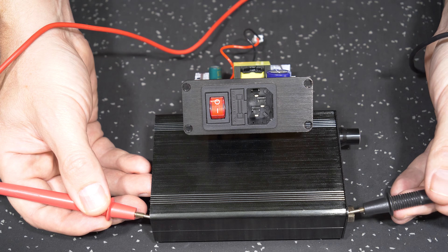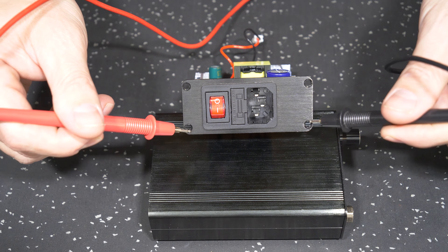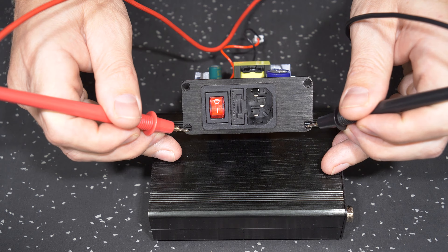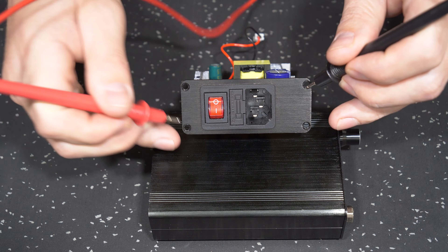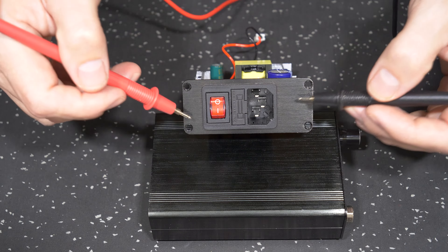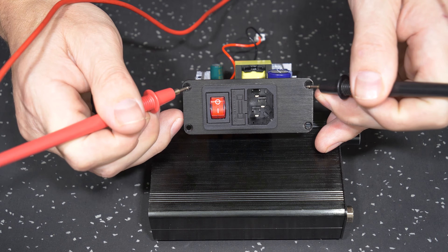We're not going to be fully convinced because we know that all faces and areas on this enclosure have been anodized. You can see that the tapered faces and the countersinking in this back plate are also anodized. With the continuity tester on, we can see we do not have a solid continuity on any of those faces on these tapered surfaces. So no matter how much earthing we do to this back plate, if it doesn't propagate conductivity or make an electrical connection to the rest of the case, you've effectively earthed only the back plate and the rest of the case is still at risk in a fault condition.